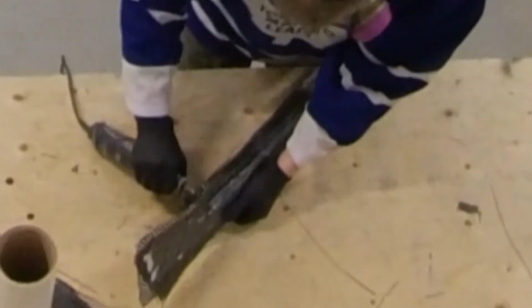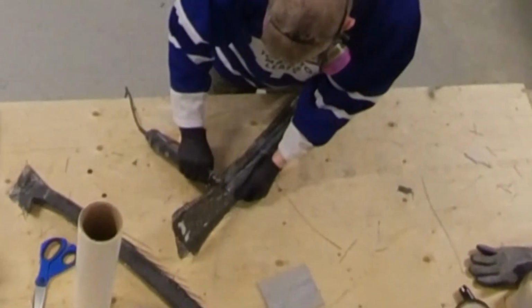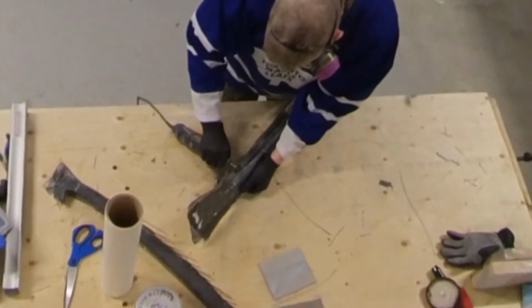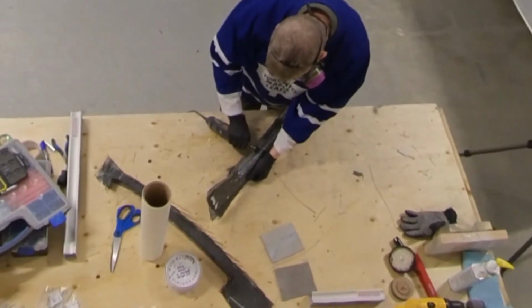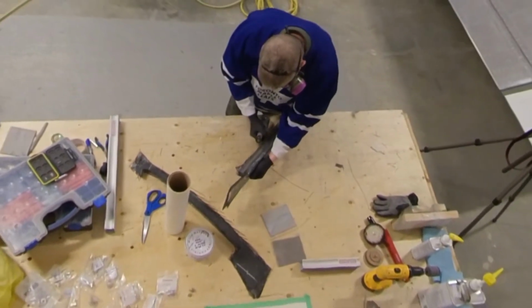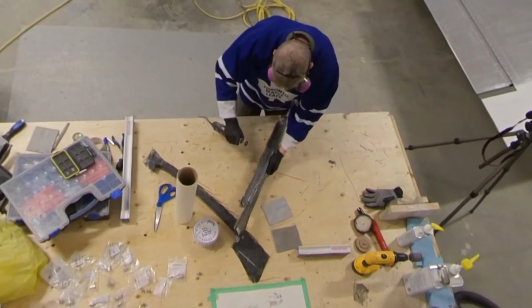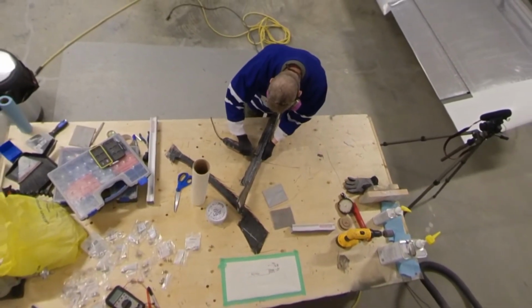And once that's all done, we're going to go rip the peel ply off. We're going to grab the Dremel tool this time because it is a little bit thicker. You should be able to see where the final trim line is because that 1/8 inch tape will have created a little bit of a ridge. But again, here we're just trimming off excess. We're not trying to get it perfect into the final shape that we want yet. So just enjoying a 360 camera video from up high.